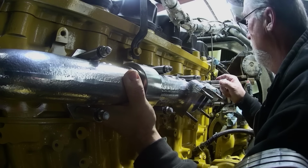And an engine with a retarder, the oil cooler is huge. It's twice as long as a normal engine. And then here's your oil manifold outlets, and they come around and they go to the filter, and then it goes back in the engine. So you got to know if you have a retarder, if you have a low mount or mid mount manifold.